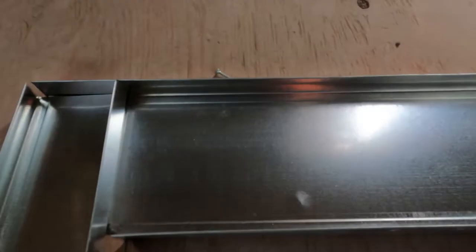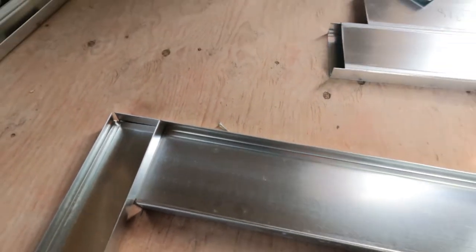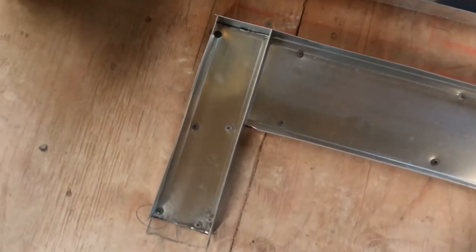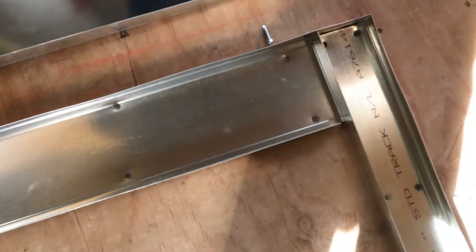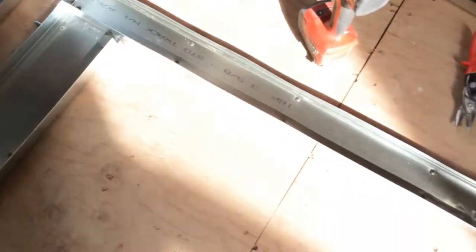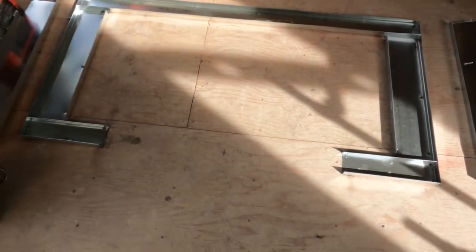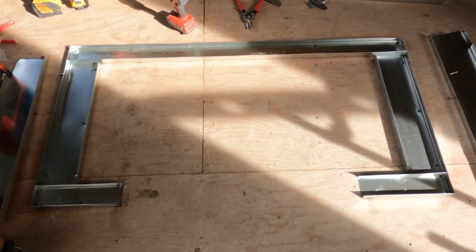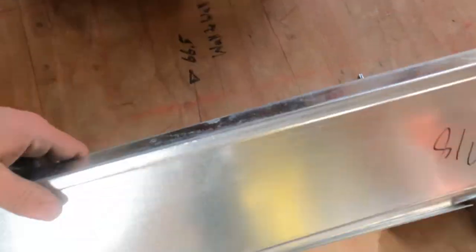You also get a nice little cap at the end for the outside corner — it's beautiful. So once all that's secure, you can see how I'm cutting for the three and five eighths stud. I'm coming back four and a quarter inches on the side so there's a three-quarters-of-an-inch space for the drywall to go in there. I do that on both the top and the bottom track.